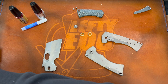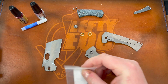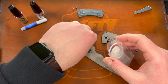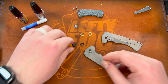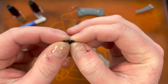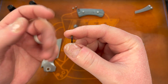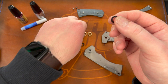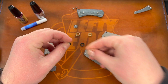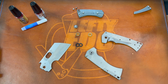I do have some Skiffs as well, I believe, but I might try the Delrins just to see how they do in there. They should fit. My issue with these Delrin bearings, they're from Tie Connector. My biggest issue with them is basically that they're not as thick and sturdy as a Skiff or Gillian because they're not in a phosphor bronze case or in plastic. So I feel like they don't offer much more pivot support compared to these stamped bearings. Even less sometimes, I think. But I want to give them a shot. So let's try that. Let me get some alcohol going here.